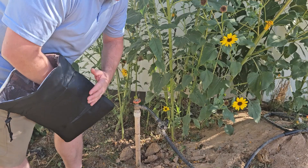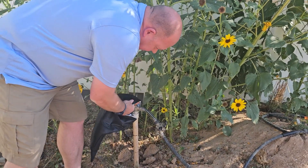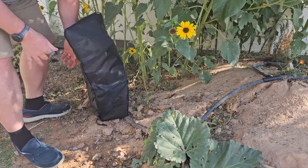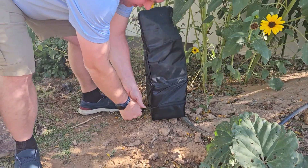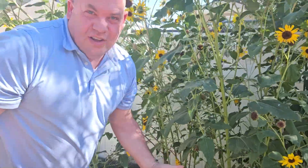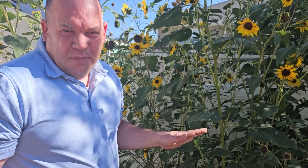When we take our hose off — and actually I can do it even with the hose on — we're just going to slip this right over the top, go all the way down, and it's got this handy dandy drawstring. You just pull it tight and it's not going to blow off. You just leave that there for the winter and it keeps your pipes from freezing.